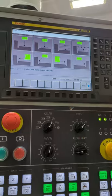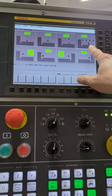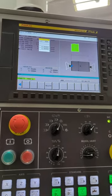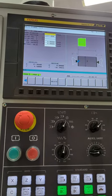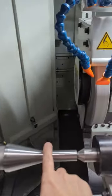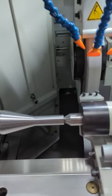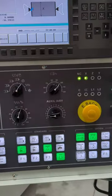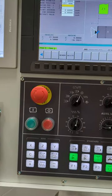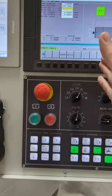And so if I have it selected, you can see the window is kind of shadowed. I hit input. Oops, I didn't hit input. Here we go. So now it wants to know a work diameter. Well, that's this guy. So what I'm using it for is right here. This final size is 1 inch. So if I put that in, and I go down, and then here, the first Z, I just happen to program it this way.